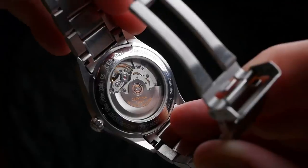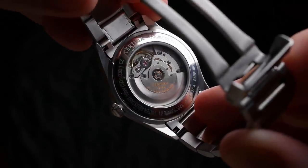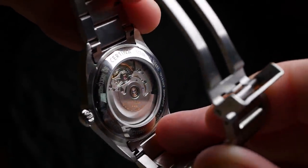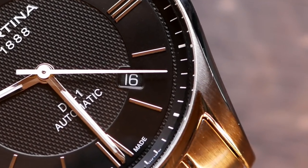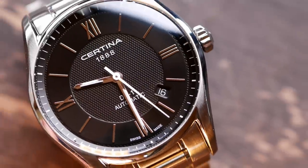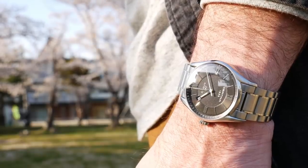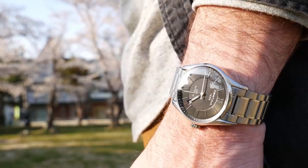Powering this watch is the ETA 2824-2 movement — a Swiss-made movement with a lot of heritage and history behind it. It's been battle-tested across a wide range of watches, is easy to get serviced, slim, and quiet. It has a really satisfying 28,800 beats per hour beat rate, giving it a very smooth sweeping second hand that ticks at eight times per second. It also houses a date that snaps over instantly at 12 o'clock. ETA claims between negative 12 and plus 12 seconds per day accuracy; on this particular Certina I'm getting around plus 14 seconds per day, just outside of spec. Overall this movement is a big step up from Seiko NH35s or Miyota 8000 series movements, and because it has a bi-directional rotor it's much quieter than comparable Miyota 9000 series movements. I think this is probably the best three-hand movement you can find in a watch under $1,000.